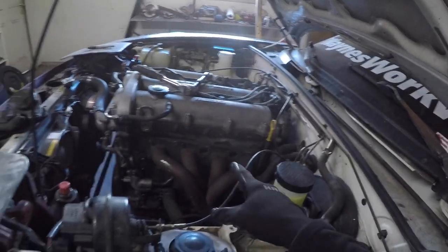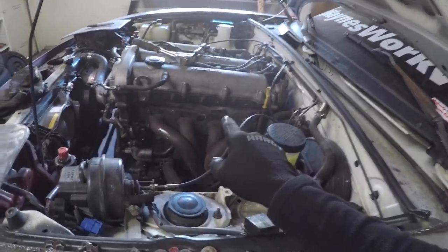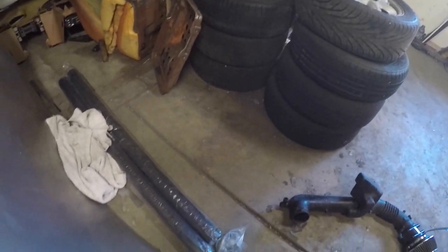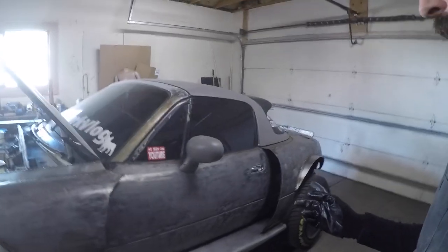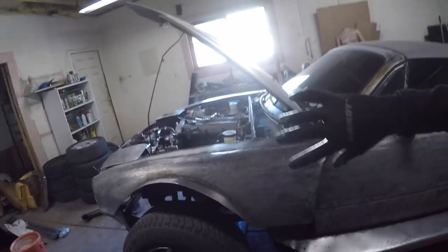Part two, here we go. I've got to pull this back out, clean up the last bit of the welds on the top right here. I've got some exhaust wrap, I'm going to wrap the actual header down to the first flange, and then I can start putting the second flange on. I got another flange kit for the rear, over the rear diff. I need to run the straights, so it's going to be just a bunch of welding, tacking it into place, making sure it fits, then pull it back out, finish weld it, put it all back together, and then we'll do a sound check.